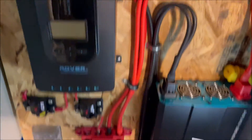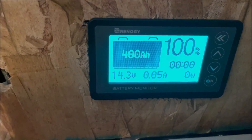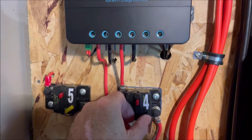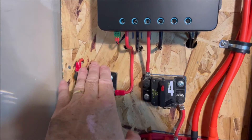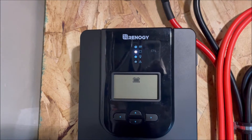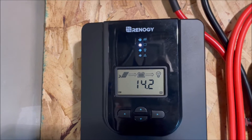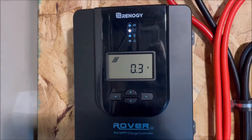The batt of insulation is all back in place. Now we can come down here and turn our battery on. Our battery is actually full at the moment — 14.3 volts, 400 milliamps. Now we're going to turn on the charge controller. Remember: always battery first and then solar. So we put the battery on and let it boot up. Okay, that's our battery voltage. Now let's go up and switch it over — this is our panel voltage — and we'll turn our panels on.